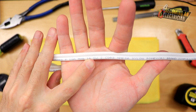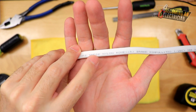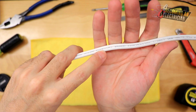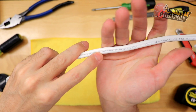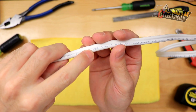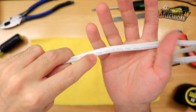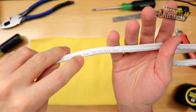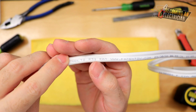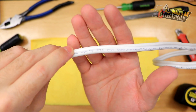Here you can see this is a 14 gauge wire with two conductors. You can see NMD90 — this is our most common type of wire in the home. You might hear it called lumex, romex, or NMD90. Continuing on, this is only rated for 300 volts, so if you're on a job site wiring something at 600 volts, always check what your wire is rated for. Also note the FT1 rating here — this is an important one to pay attention to.